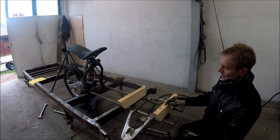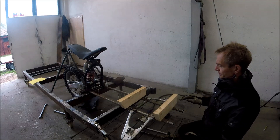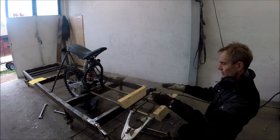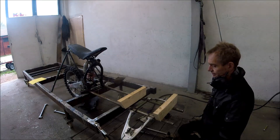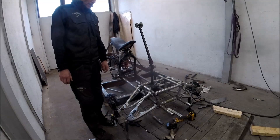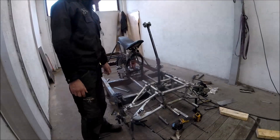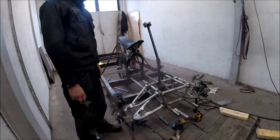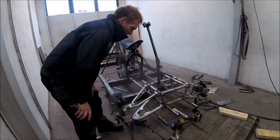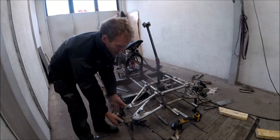I measured and it's 150 millimeters between the fixing points for the wishbones, and these are 120 millimeters, and these tubes are 30 millimeters. So if I tack the upper wishbones to the same tubes and get them in position, I think it's going to work. I had some trial and error — I lifted the steering rack from the snowmobile up and down and tried different positions, but I think it's quite good.